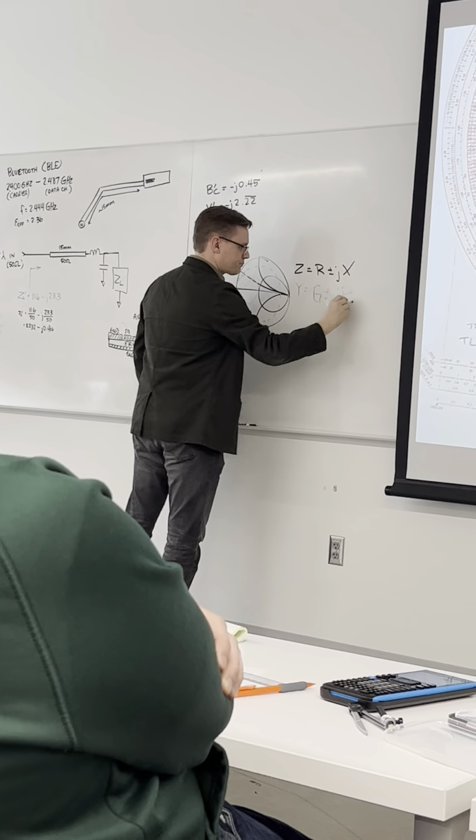So these are our starting values. This obviously isn't the value of our capacitors or our inductors. This is just part of their impedance, the reactance of those components. We need to know the frequency, and I already gave you the frequency. So the capacitor is C = 1 over 2 pi f XC. And L is XL over 2 pi f. Yes. So you pop those in, and you should get some numbers come out.